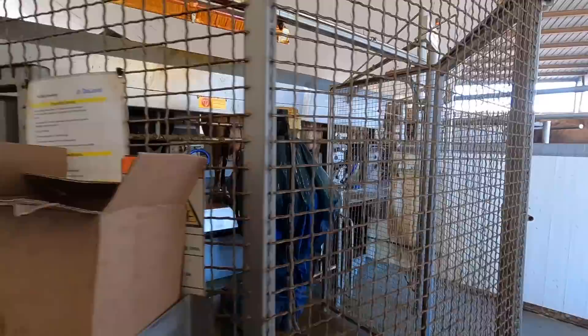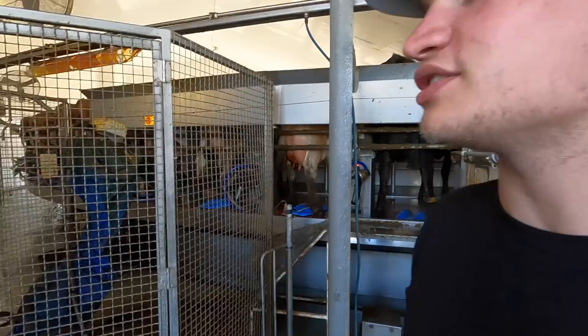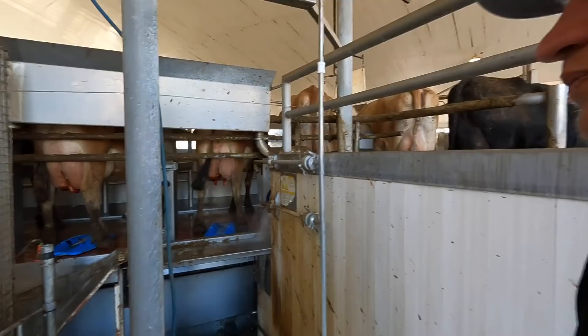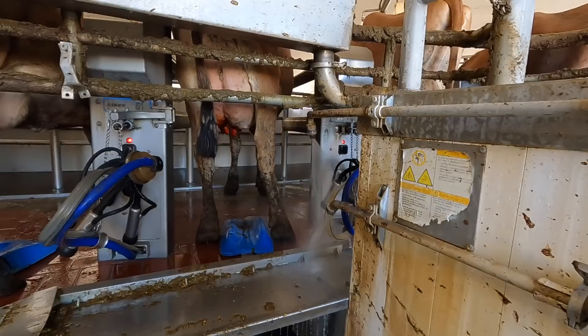The TSR has a camera on the front that looks for the cow's teats and then sprays iodine post-dip — a disinfectant to keep the cow's udder healthy. It's got a little control screen and a big red button if something goes wrong. They also have a butt pan here, because a lot of cows will defecate right at this point on the rotary, and you don't want manure getting on the robot's camera. It conveniently cleans itself as well. Right at the end of the rotary, before the cows get off, there's water spraying to clean the milk claws before they're hung under the next cow.